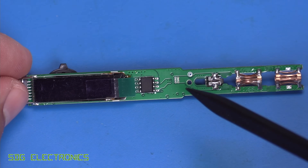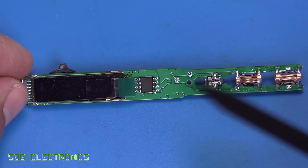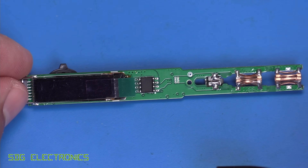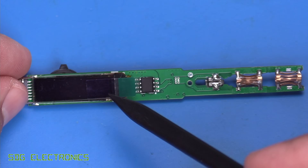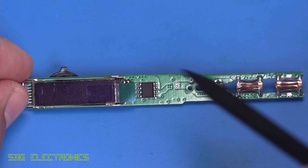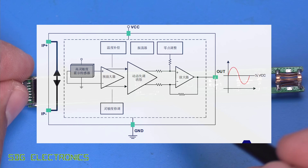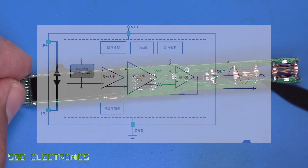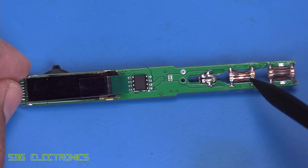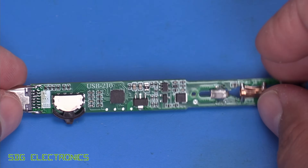The unit came apart really quite easily — just a couple of screws and you're pretty much inside. If you ever did need to do any repairs, it can be done without making any damage to the chassis. We've got the OLED on the left, then we've got a current sense chip — this is a Cross Chip CC6903, which I think we saw in the GVM-H3. The input is isolated and it's able to measure AC as well, allowing you to do some measurements with an analog output. We've got a couple of contacts for gripping onto the cartridge, but most of the other components are on the other side.